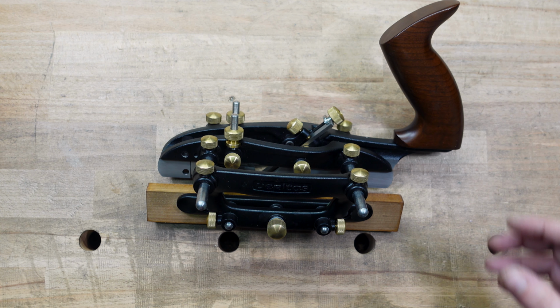Tape measure, basically going to be the same thing. The reason I don't like the tape measure is because the 1/4 inch is right here and it's hidden. So it could be easier for you to mess up and go to a different line if you don't, I guess, know the tape measure as well. I don't know. But you would take it, go like that, make sure it's where you want it. Depth gauge, same thing. Can't put it this way because it'll go under. You need to turn it sideways like that. Check one side, check the other side, make sure it's where you want it to be. Combination square. Those are a little bit thicker, so it shouldn't slide under, but if it does, just tilt it to the side. Make sure it's where you want it to be.